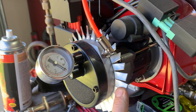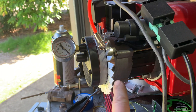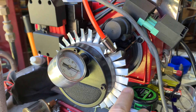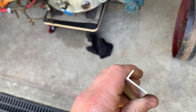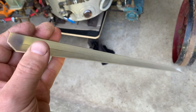This has been the solution. These pumps come in much larger sizes for the bigger models, and for that you would probably need a 20 by 40 millimetre aluminium angle to make fins up. This stuff is good — it's extruded aluminium so it's nice and tough, and it tends not to corrode.